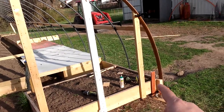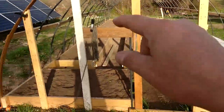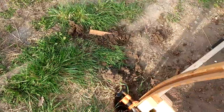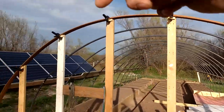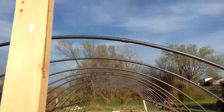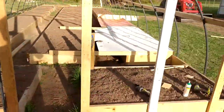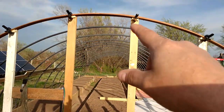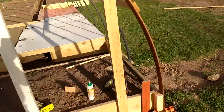When doing that, you need to match the length of the first board plus about another three-quarters of an inch on the end, because the second board will be slightly longer. What you need to do is dig a small hole so the board goes into the dirt a little, find the length that matches, then trim it off after it's in place. Let it sit overnight and let the glue harden. Come back the next day and take all the screws out that hold the two together — the screws protrude a little bit, so remove them before adding the third piece.